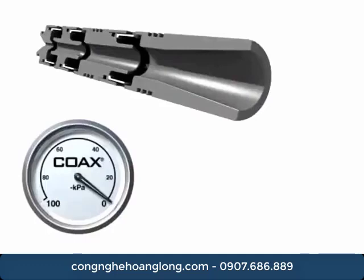The largest nozzle at the end of the cartridge provides the highest flow but the least amount of vacuum. The smallest nozzle at the front of the cartridge provides the deepest vacuum level but the least amount of flow. As the cartridge is running and vacuum is building in the system, the flap valves will close.